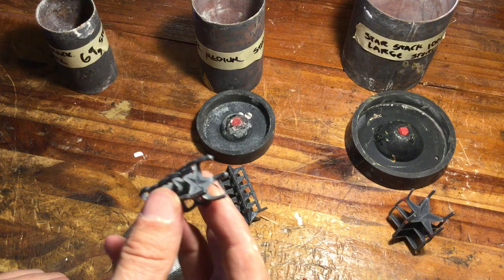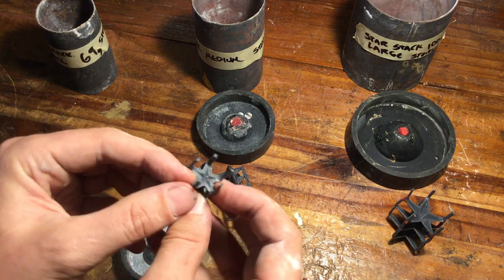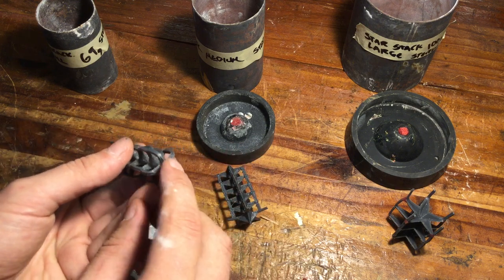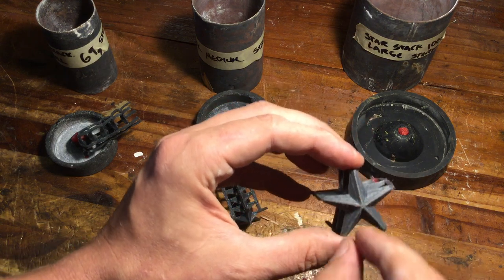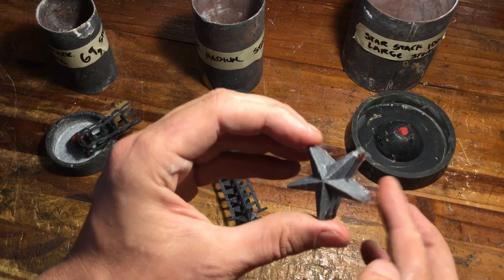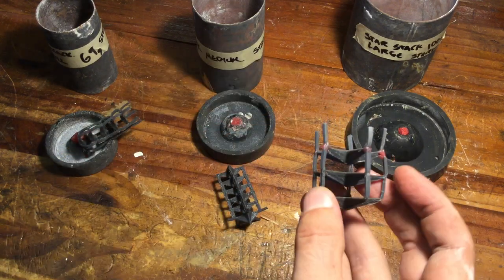We want to make sure that we're dealing with the average thickness of our piece. This entire part is designed to be about 2.5 millimeters thick uniformly. But if you consider the point of this star, there's still a lot of material that needs to be fed into that opening to get to these individual sprues, and then those will come and backfill each separate star.